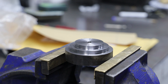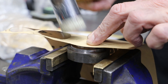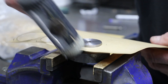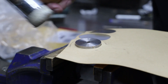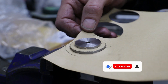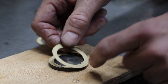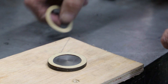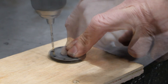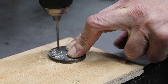For circular gaskets such as the cylinder covers or valve spindle guides, my preference is to turn a die block and then use a soft hammer to cut the gaskets. Here I've turned the die block to the corresponding internal and external diameters for the cylinder covers. I again use the part as a template for drilling through for the bolt holes. For the cylinder covers I can only get three on the register so I cut three at a time. It's worth noting that I'm making quite a few spares whilst doing this as I've no doubt I'll be needing them in the not too distant future.